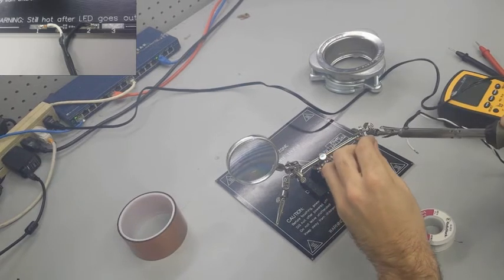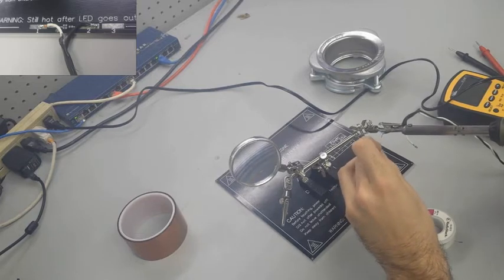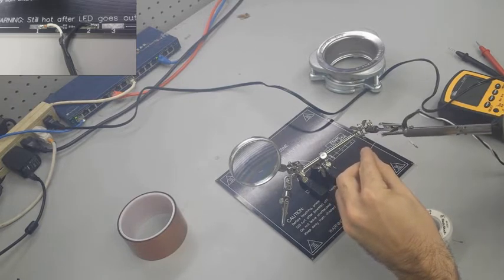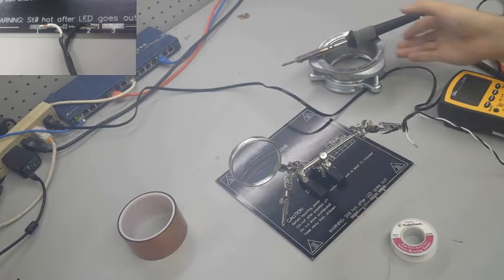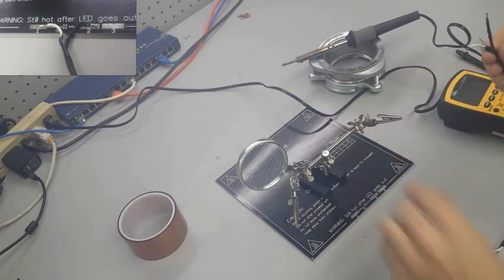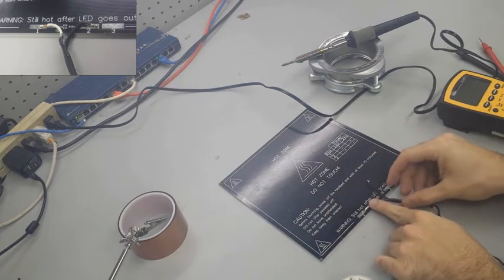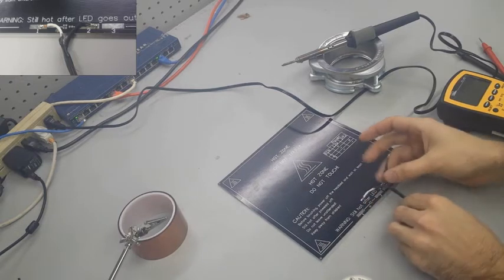And we do that so that when we go to solder it to the board, it has that silver so that it can adhere to it. So what I'm doing is I'm plating or coating both sides of the wire, both wires, so that they have silver coats on them. And this side of the wires is going to go on the heat bed. So once you have got a pretty good base of silver onto the copper, we're gonna pull it out and take a look at it, make sure we have a pretty good coat on there.